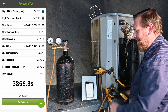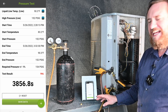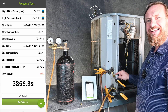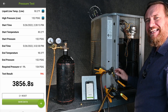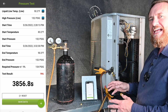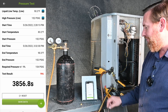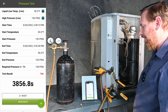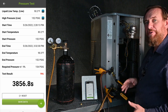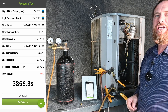And our test results are a fail. Notice that our temperature did go up, but our pressure stayed the same. The reason the pressure stayed the same is because I didn't put the little caps on and didn't tighten these down, so they were actually leaking — done on purpose so you could see the difference. We started at 152 and ended at 152, but we should have gone up to 154. Ultimately, we lost 2 PSI over this timeframe. It's important to realize that the pressure test method has to also take into account the temperature.